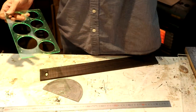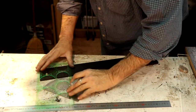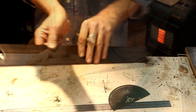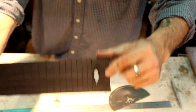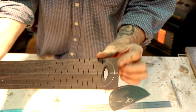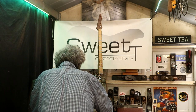Now we can trace this fretboard out on here again so I don't have to do this after we get the fretboard glued to the neck. We want to go ahead and redefine this half-moon shape. Just like that is what I'm after. I'm going to get over to the bandsaw and cut this out — we need to get that shape finalized before the fretboard gets glued to the neck. The sides we can flush up on the router table, but we can't do anything to this end on the router table because our truss rod nut's going to be in the way. We'll clamp the fretboard down to the table and take a file or Iwasaki to get that shape rounded up.